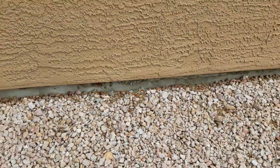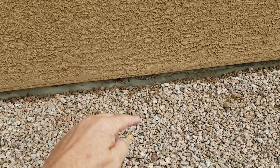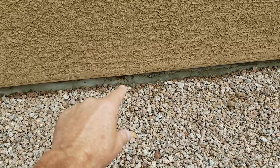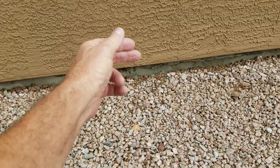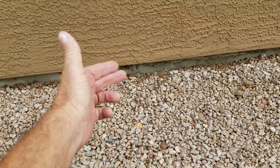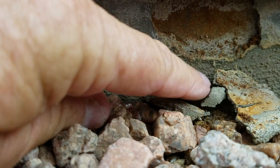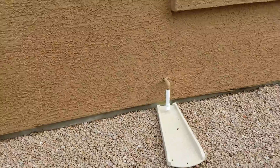Over time, these houses are all painted when they're done — they're only painted down to the top of the dirt. The dirt gets wet below the paint line, moisture goes in and evaporates, leaving efflorescent salt deposit. That's why I recommend waterproofing from top to bottom, to stop moisture from penetrating, depositing salt, delaminating any patch material, or oxidizing any reinforcement steel. Here's another bubble — this is just crumbling off. The dark spots along here are indicating that moisture is present.